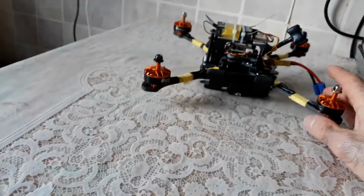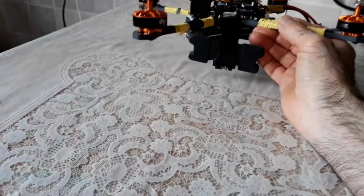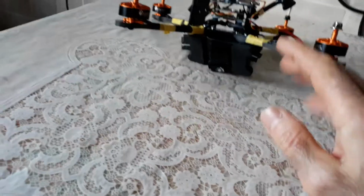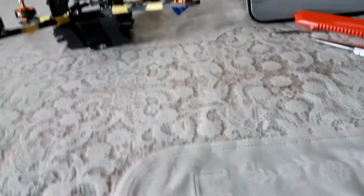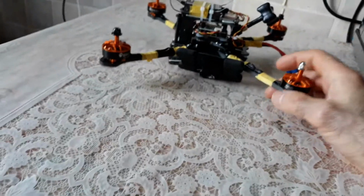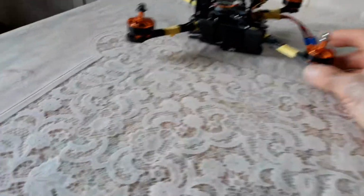Okay, another thing, do not fly before you test your fail-safe, GPS rescue. Unfortunately, with my fail-safe rescue, I don't know if it's going to work. Manual mode doesn't work for sure because I have no extra channel to set for that, because 7 channels is not enough. Otherwise I have no rescue mode. If I put in the fail-safe mode, bit disappointed, but unfortunately my radio is only 7 channel, and this needs more than that. If you have a Spectrum with 8 channels and above, then you're going to enjoy it definitely more. But me, unfortunately, my radio is 7 channel. I cannot enjoy it the most. I need to wait for my new receiver. So I'm going to use a different radio.